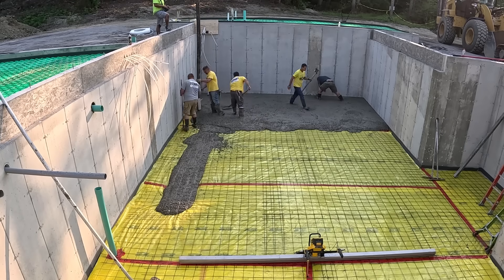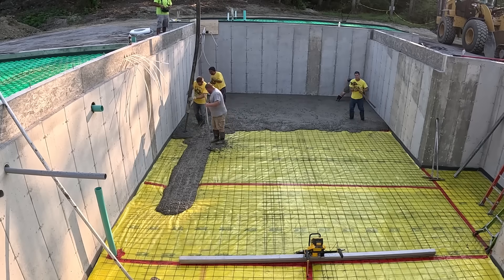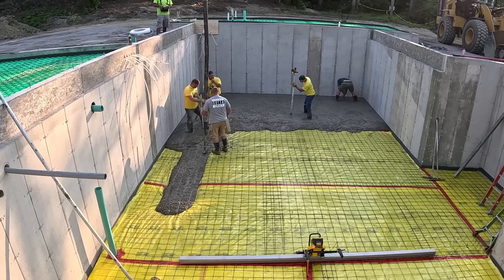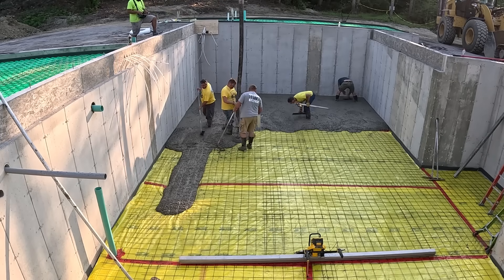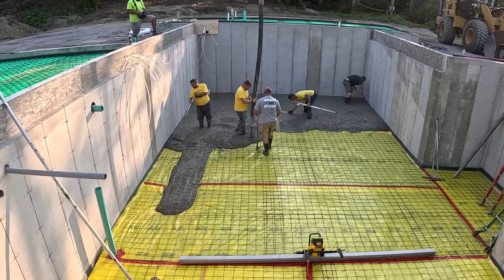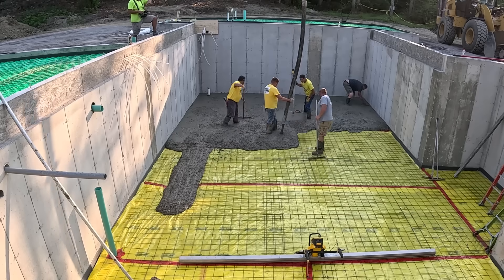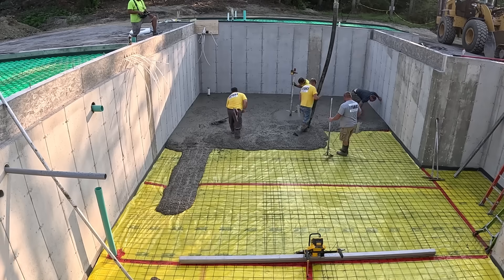The little piece we poured in the beginning was basically a footing. And then you can see on top of the concrete wall, LaJoy Brothers from Augusta, Maine did the walls and they left a shelf in the top of that wall, so the floor trusses will sit right in that. And then there's a set of stairs coming down right where we did that footing part to start with — that thickened area.